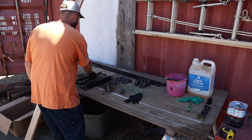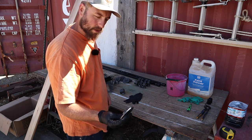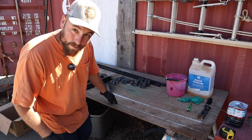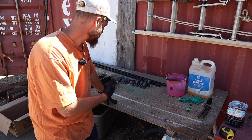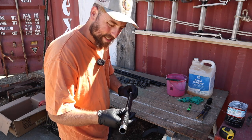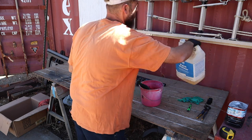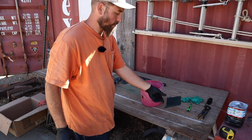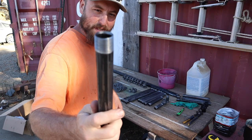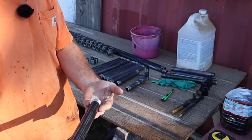As we get a little further you'll see how I'm setting it up. I'm going to do these flanges that'll attach to the underside of the top. First, because this has a coating on it, almost like a tar but some sort of paint, and they're pretty greasy, I'm going to scrub everything down with paint thinner and some scotch brite. I like the look of them when they're sanded — I leave a little bit of the black, it just gives it some character.